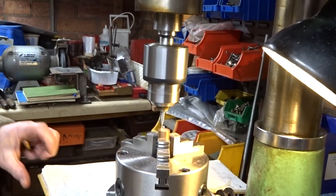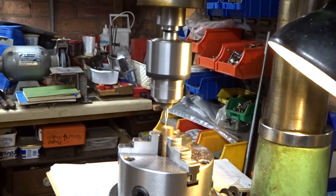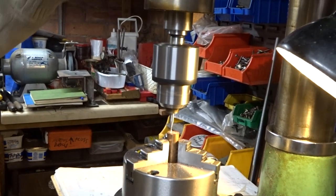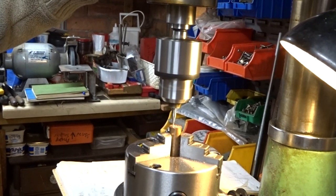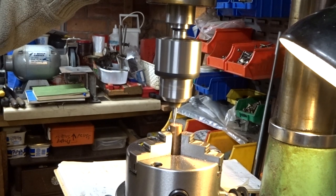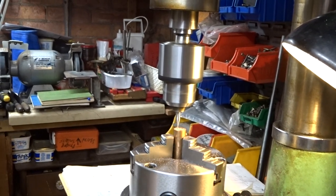I'm using a 1.5mm diameter end mill to mill the semicircular slots in the reversal block for the engine. It's times like this when the rotary table comes into its own — not a thing that I get very dear use out of, but when you need it you need it.